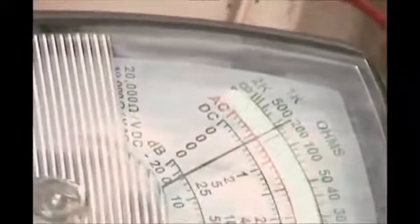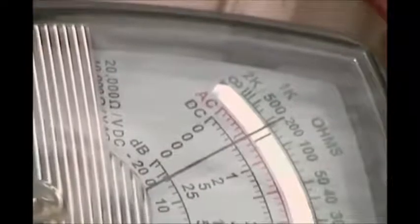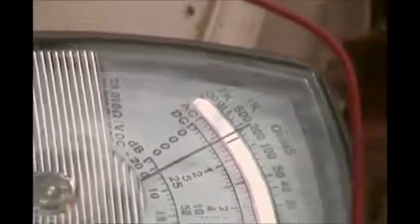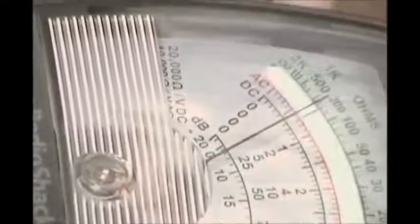When we first put them on, they were reading almost zero, and they finally got up to about 0.6 volts. So they're charged up to 0.6 volts. And in theory, if we put them in series, we'll start getting multiples of that 0.6 volts. This is then hooked up to the shovel here — the shovel is the ground, which is pretty convenient. Obviously if we had a better ground it would be better, but this is working. This is not optimized yet, and the nails probably aren't either.